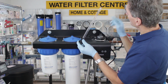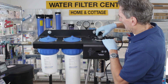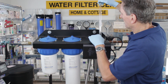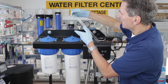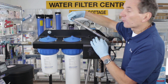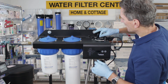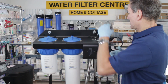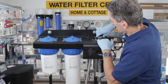If you're not wearing gloves, you can only handle the sleeve by the very end or use a cloth. Unscrew the bolt, set it aside, and then pull out the quartz sleeve. This quartz sleeve is brand new for this video, but what you would do now is clean it with CLR or a similar product — it has to become perfectly clean. If it's not perfectly clean, it will compromise the performance of the UV, so if you can't get it perfectly clean, replace it. When you slide it back in, make sure it goes in perfectly straight — there's a spring at the bottom. You can see the O-rings already on it; take the gray bolt, put it back on top, and thread it in hand tight only.